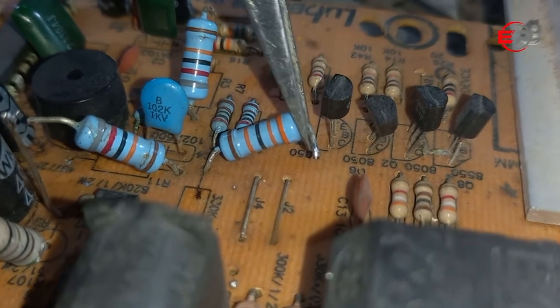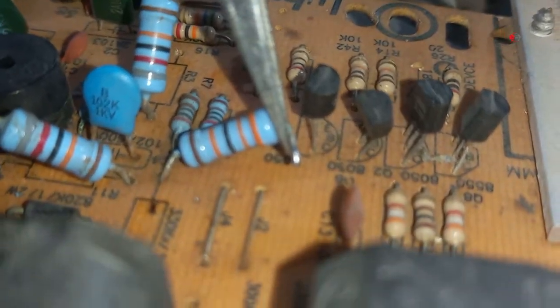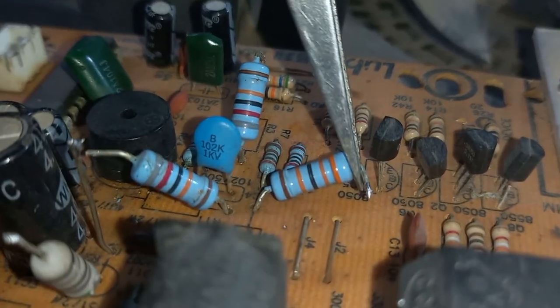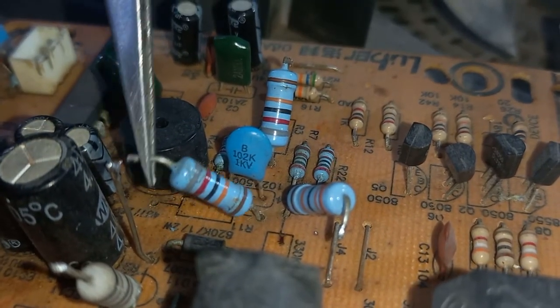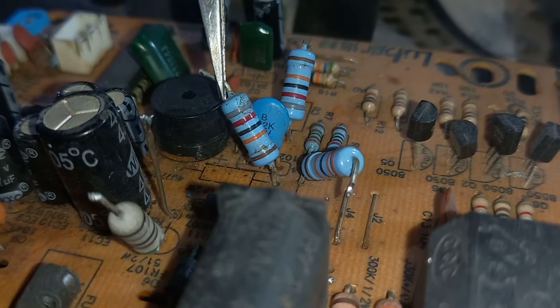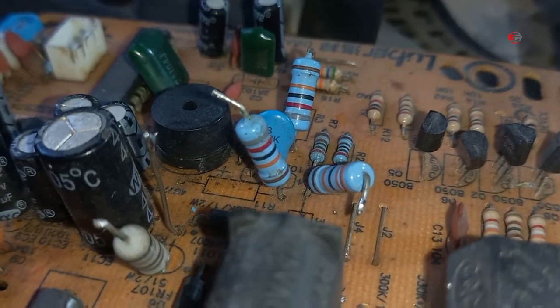In this case, you can check the resistors in the divider section, which may be 220k, 270k, 330k, 470k, or 820k — either 1 watt or 2 watt. Resistors of the same value have to be replaced after checking.